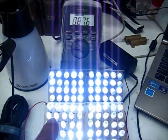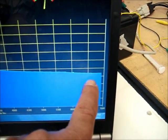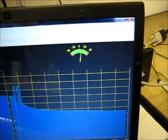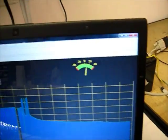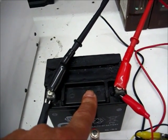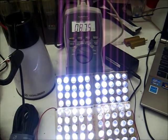Our load impedance has equaled the cell's impedance because we're holding at this voltage — you can see a little rise right here. 8.76 divided by six cells is 1.46 volts per cell on this alum battery. So what I think I'm going to do is put a more extreme load on it — a 65 watt car light — and I'll be back to show you that.